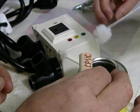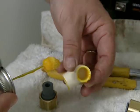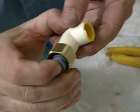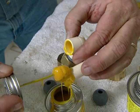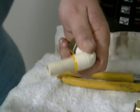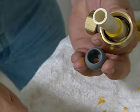Now the opposite side of the pipe, right around. Now we're ready to glue it up — one half of the elbow. Bring that together, the other half of the pipe. It's colored so that you know that you made the connection properly, for a three count. Now I've got to remember to put this nut on first — if I don't, I'm in trouble. So that goes on, and now my last connection is this ball swivel.